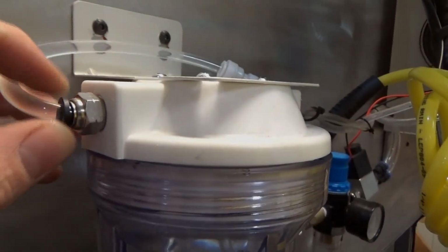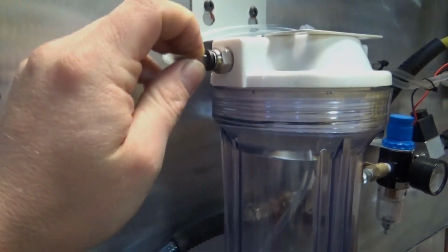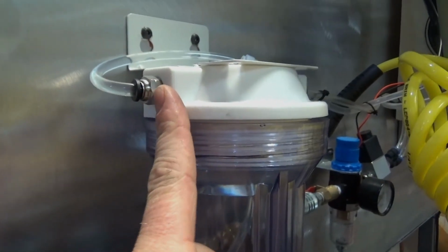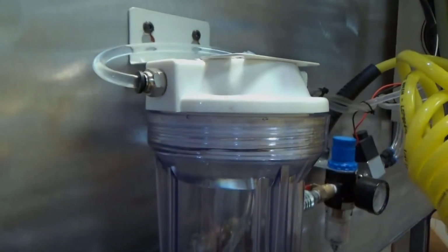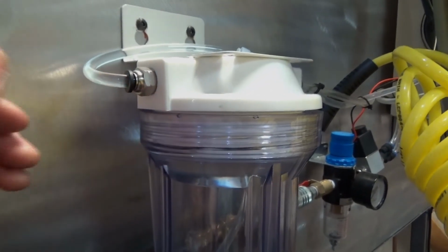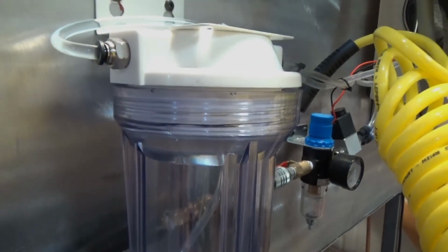One thing I will say about getting the hose in this, because normally there's not a line going down there to suck fluid up, it's just filtered through. So the way I did that worked out pretty slick. These fittings, if you ever look at them, there's just like a gripper in there that seals the hose, and then the hose just hits a machined-in metal stop in the fitting. What I did was just drill out that machined-in stop so this tube could just keep going through the fitting. It still seals, everything works like normal, there's just nothing to stop it from continuing through. So basically you put that in, continue it through, put a union on it, and then just put another length of hose on, and that works fantastic.